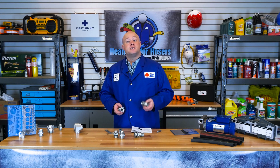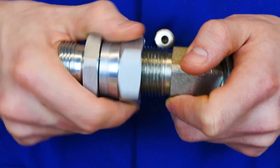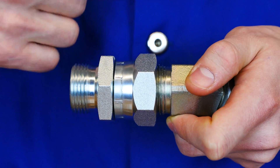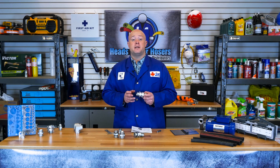Now we will get into how to install the different types of BSPP connections. Because there are two types — port and non-port connections — they will install slightly differently. For non-port connections, a BSPP connection is installed by turning until hand tight, then completing one and a half turns to ensure it is tightened. Leaks are commonly caused by being too tight or not tight enough. If you over-tighten, you can mushroom out the seat of the fitting, and it is recommended that you replace the damaged pieces. If the seat on either the male or female connection is damaged or pitted, it can create a leak path, so we recommend changing your fittings.